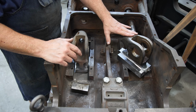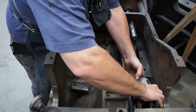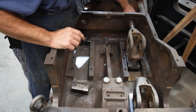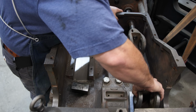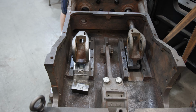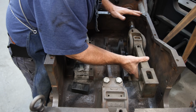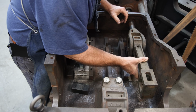So we got this one poured and we set it up over here on the shaft so it was properly centered on the shaft and so forth. But here's the potential problem, and let me show you. This is the other crosshead for the other side that doesn't have the Babbitt poured on it yet. In addition to having this thing centered up, obviously it can rock from side to side a little bit, and it has to be in alignment. Let me just set this one over here for the moment. There is a connecting rod that will come down inside of this, and this goes up to the crankshaft, which is back here. That's going to actually move this back and forth. And for this to work right, obviously it's got to be in proper alignment left and right.